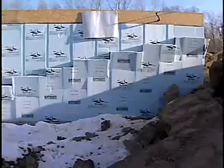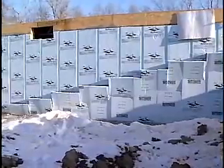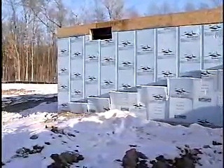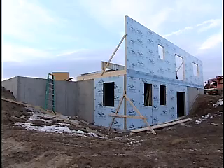What are your recommendations for exterior basement insulation? On the outside of a basement wall, foam would generally be installed over the waterproofing membrane, with the bottom of the foam resting on the footer. It can be temporarily attached to the wall with an adhesive or maybe one mechanical fastener per board, because the backfill will eventually hold the foam in place.